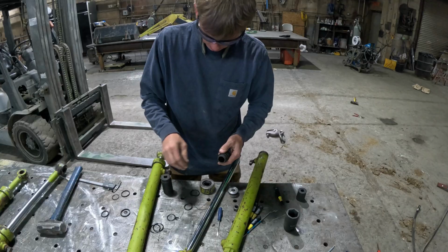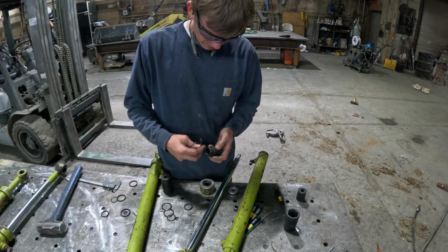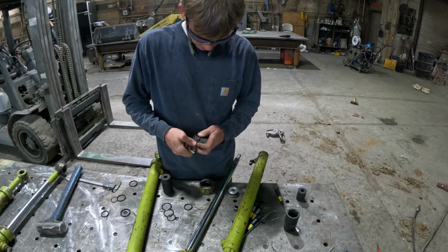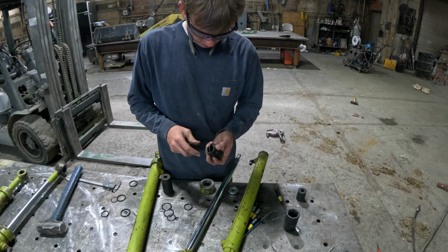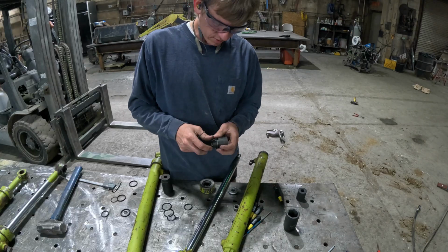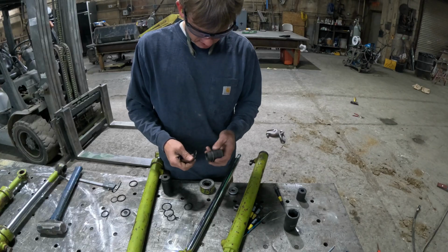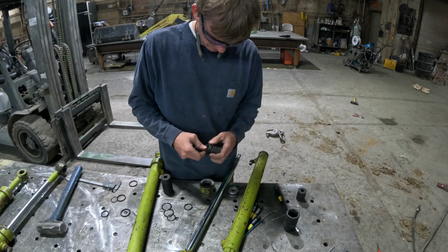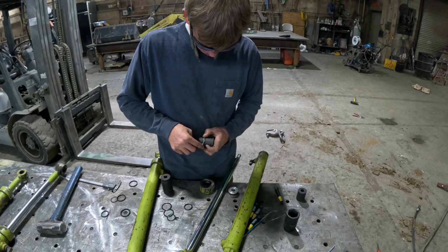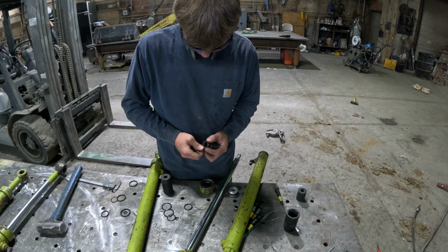There's that one, and then we've got a washer for this gland seal, but there's actually not enough room for the O-ring in the washer without machining that out, which would be more proper assembly, but for this, it's fine. Since this is just a gland seal, it doesn't move. But the trick is not twisting your O-ring when you put it on.